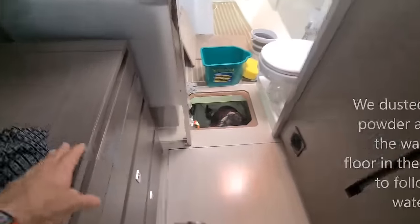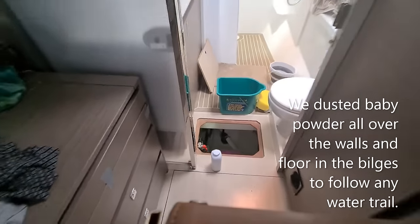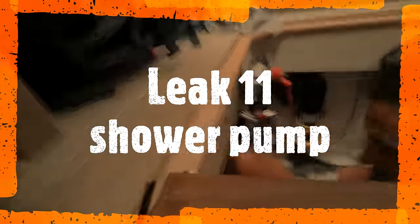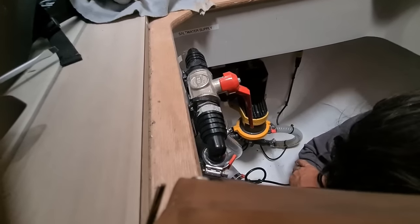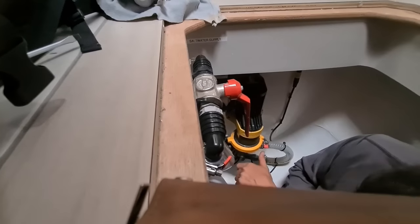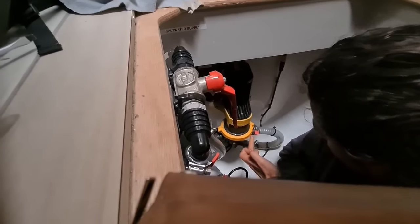Using baby powder, Carol's found another leak or source of water in that bilge. Melinda and Garen have gone forward to try to find out what that is. There's a whale-branded pump in here and it seems that's leaking. It's the shower pump leaking - but it's fresh water. Carol says she's definitely getting seawater in the front, so we've got more than one leak there - the shower pump is one, but there's also seawater coming in separately.